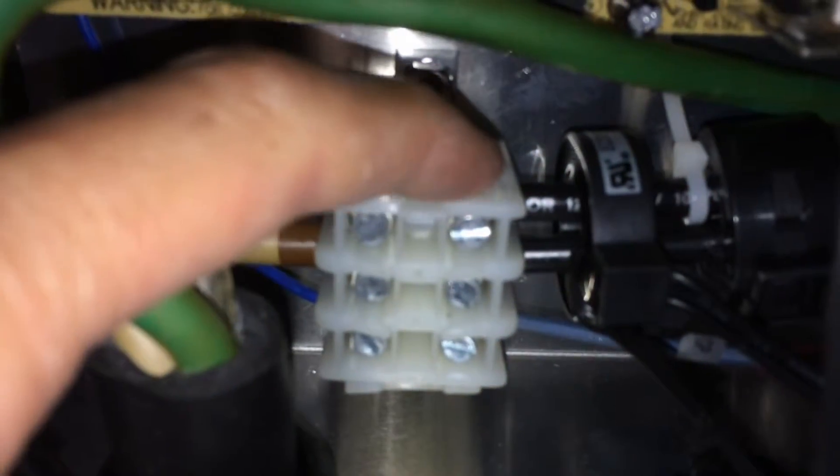What we're looking at here is the power coming in from here. There are crimped connectors that go into this junction block. On the other side of the junction block the wires come out, they go through this current transformer that measures the current, and then through what looks like the same thing — but this is technically not a current transformer, this is just to reduce RF interference. I think it's called a toroidal. And then it goes to the rest of the system.